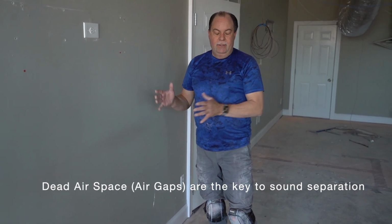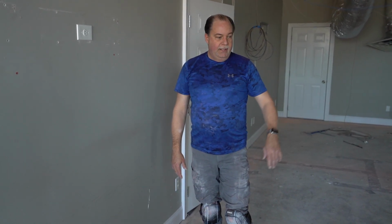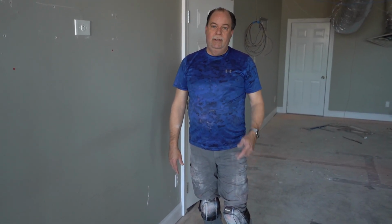So that's the way that you use dead airspace to stop vibration or sound waves from one wall to the next. So we'll come back here in a few minutes as we start gridding out the floating floor and give you a little bit more.